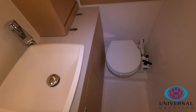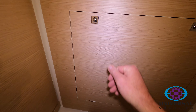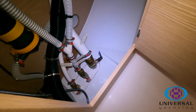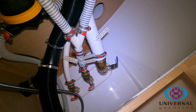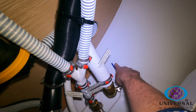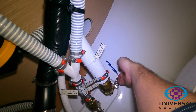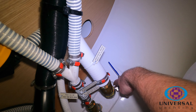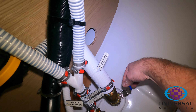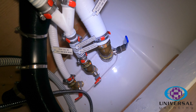As we go into the forward heads, you can see the toilet, sink, and that panel is where the holding tank sits. If you open that up, you can see the holding tank underneath the sink and all the outlets and inlets for the toilet. The right hand blue handle is the waste outlet — if you want to use the holding tank, just close this handle and all your waste will sit in the holding tank until you open it again. Be careful when opening the holding tank: there's a little metal slide on the handle to prevent you from accidentally opening it, so push that slide to the right and then you can open the holding tank to discharge the waste. The middle seacock is the shower pump discharge and wash basin discharge, and on the left is the toilet water inlet.